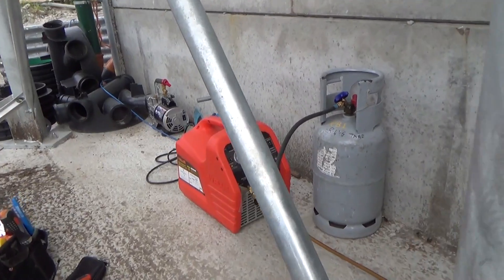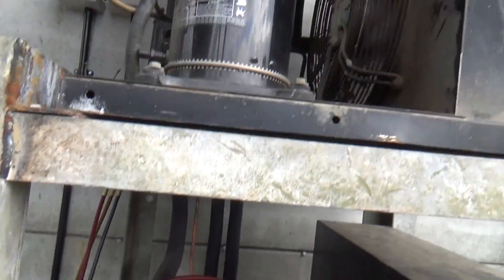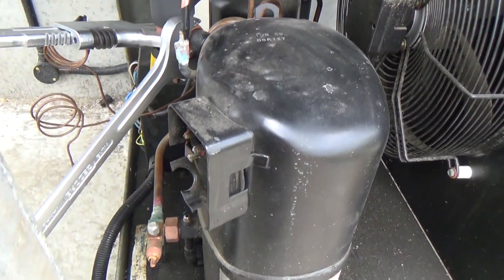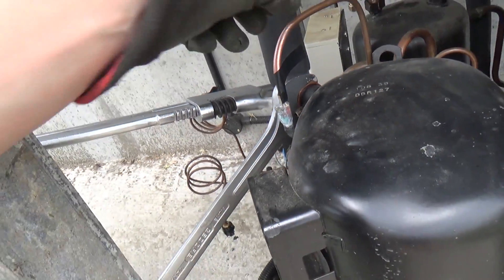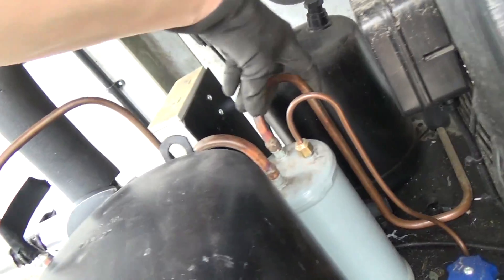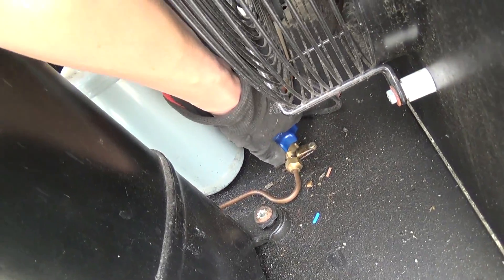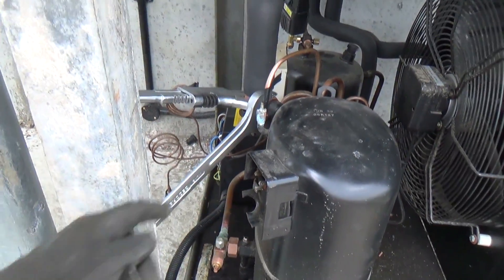I've got the recovery machine going. The top of the unit's up now. I've got all the gas taken out, the wires disconnected. We've took the pressure switch connections off and put some tape over them to keep dirt out, and the oil return line from the oil separator — that's where the oil goes back out. Any oil that comes out of discharge is separated in here from the gas. The gas carries on off to the condenser. The oil comes back up this little pipe through a tap, which you normally leave open, and then just dumps back into the crankcase. So I've got all that disconnected.